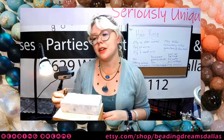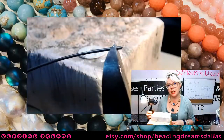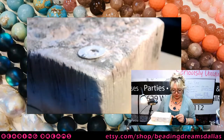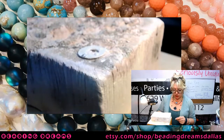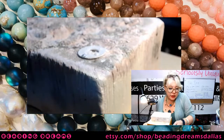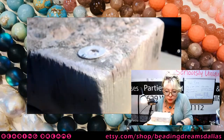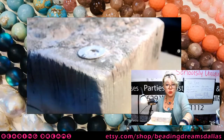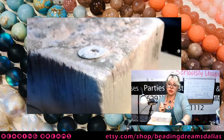I'm going to cut my solder. Very small pieces, just like a 16th of an inch, and I'm going to cut 4 of them. I'm just putting them down on the table in front of me for the moment, because then I'm going to take tweezers. Tweezers are a very important tool to have in your soldering workspace. Why? Well, because hot things for one, tiny things for two.